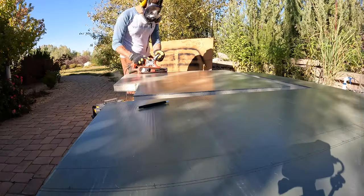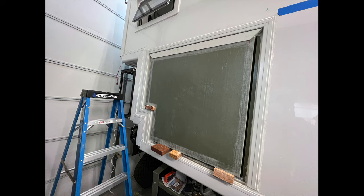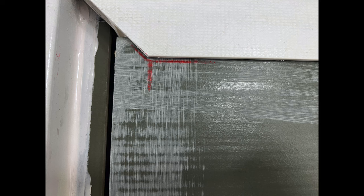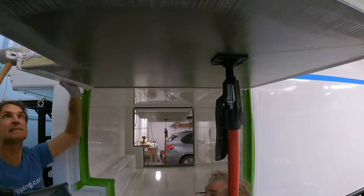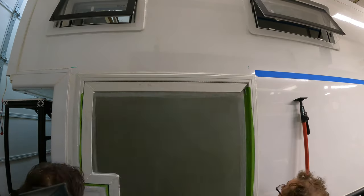From the composite panel video, I went ahead and sanded the edges around each door before gluing on the protrusions, then took the door panels and glued them up onto the upper protrusion already mounted to the hinge. I put little shims in to make sure the door did not move down — the adhesive sealant is so strong it holds the doors up perfectly, but I put small pieces of wood in just as insurance. Came back the next day, everything was bomber. Then it was just a matter of holding the door up and gluing on all the protrusions all the way around — previously cut, glued on with a lot of adhesive sealant, well sealed all the way around. These doors are now completely trimmed out, sealed up, and bomber.